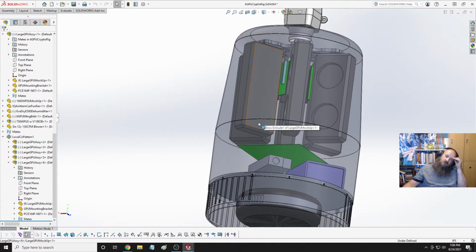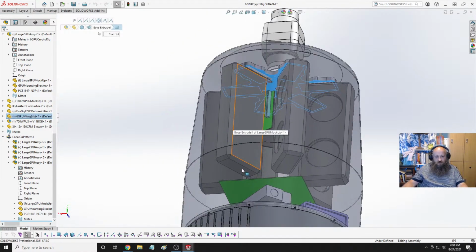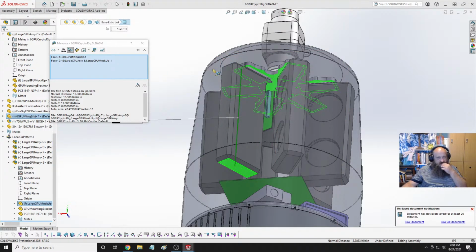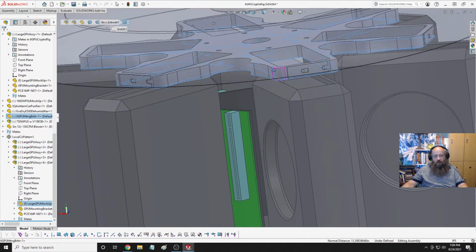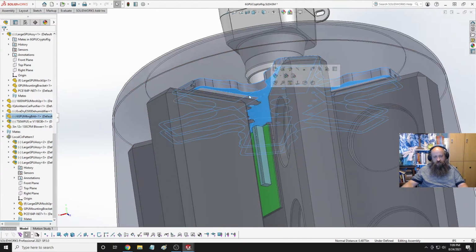Let's see. For a GPU, there's nothing down here that will mount. So I want my threaded rods, or my slide rods, sorry, to be slightly bigger because we're providing the screw holes here and then a screw hole here to secure all that. 13.38. So let's do 13.5 inches in length on my slide rods. 13.5 inches in length. Nope. That's going to be 13.5 plus this number.